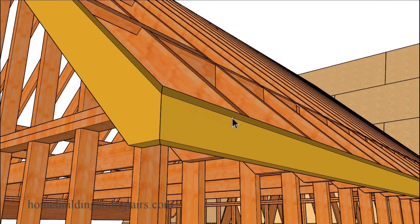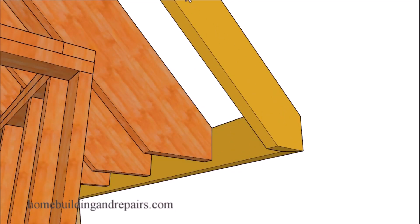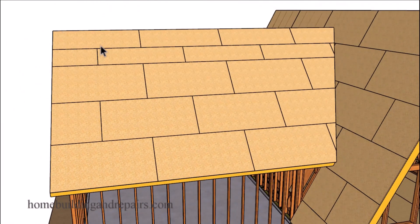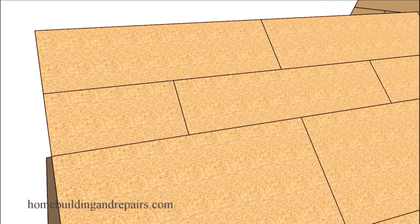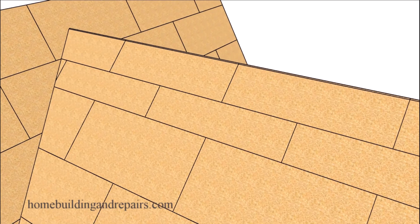Our shaped fascia board is going to require some notching to make this side blend in with the other side. Let's add the roof sheathing and wrap up. I wasn't able to use a full sheet because I was about three or four inches short at the top — I had about 52 inches instead of 48 inches. If your engineer does not allow for that, for example with a two-foot minimum width requirement, you're going to need to cut separately and waste a little bit of roof sheathing. Thanks for watching — if you enjoyed the video, let us know by hitting the thumbs up button or in the comment area.